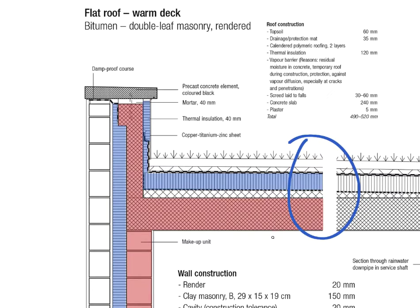In the roofing construction detail, we have concrete as our load-bearing layer, and then on top of it there's a screed, which is probably made out of a cement or concrete-type material. As we can see in the description, it says 'laid to falls', meaning it's a little bit thicker on one side than the other. Given that this layer is slightly inclined, every other layer on top of it — especially the insulation — will have that incline as well. Therefore the water can flow in that direction.